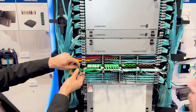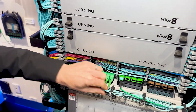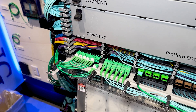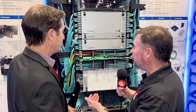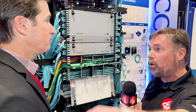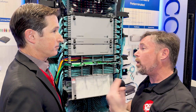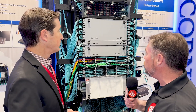You'll notice it's cleaner and a lot fewer cables — it is half the number of cables actually coming in and through all of your cable management and routing. Most of these LC connectors generally carry unidirectional fiber — there's one fiber for going and one fiber coming back — although there are applications where you would have a single fiber that can have bi-way communication, called BiDi. This is the most common implementation in the industry.